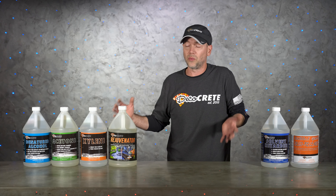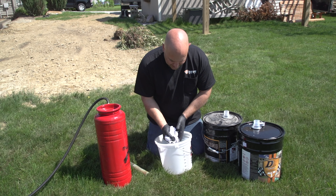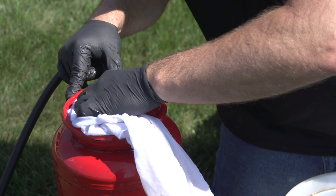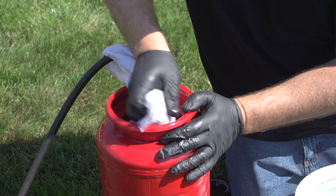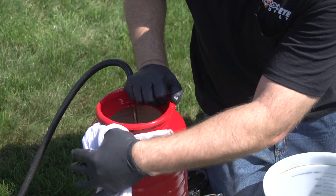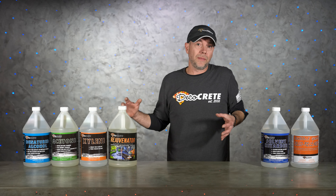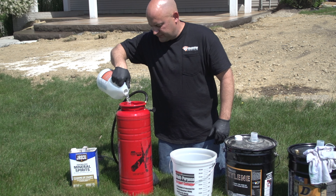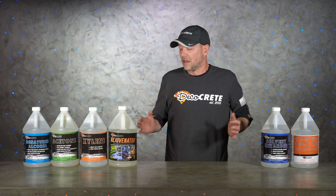These days the main purpose for xylene is going to be cleaning out your sealer sprayer, and it really does work great for that. We could use acetone for this, but xylene is just a lot slower drying, which gives you a better chance of cleaning out that sprayer. It also has a little bit of an oily feel compared to acetone, which is actually good for keeping your sprayer lubricated. Another option would be liquid release — that's the stuff we use to stamp concrete — it will clean that sprayer out and lubricate even better than xylene.